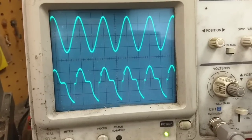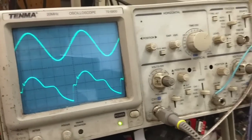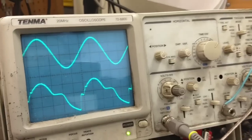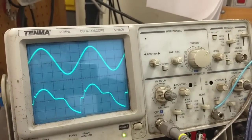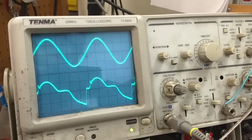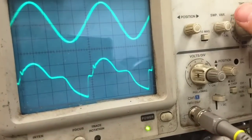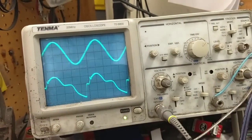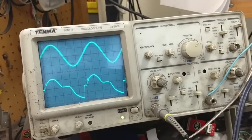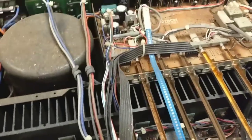Keep moving the camera up. I'm not paying attention. Crazy. Tone controls only have minor effect. Loudness sure pisses it off, though. Interesting. Let's spray some contact cleaner in these pots, especially these input selector switches. This is bad. Alright, let's get some deox into these.